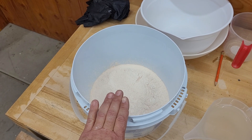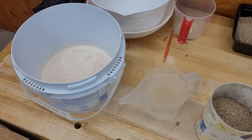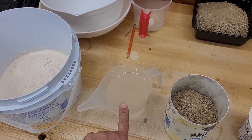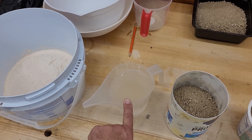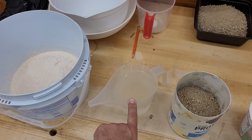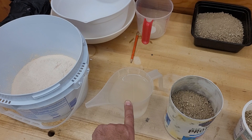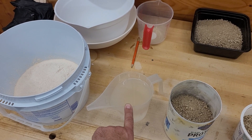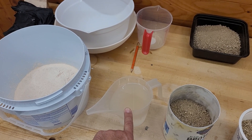This is a kaolin clay calcined to 750 degrees Celsius, and I have a total of 717 grams of metakaolin — that will be 40% of the binder mix. Next to it I have the silicate mix, which is roughly a 50/50 mix of potassium silicate and sodium silicate, and that represents 60% of the binder mix, approximately 1,076 grams.